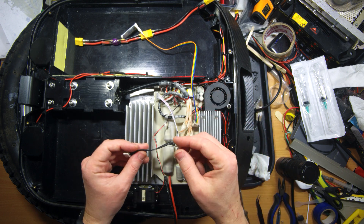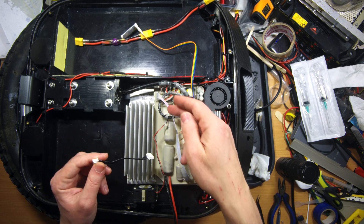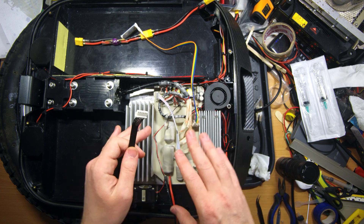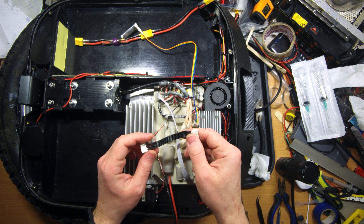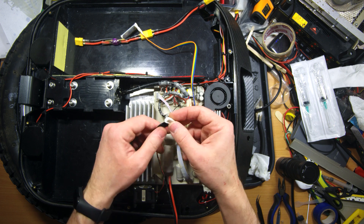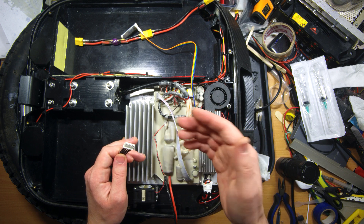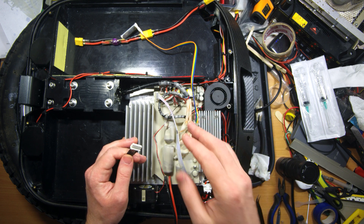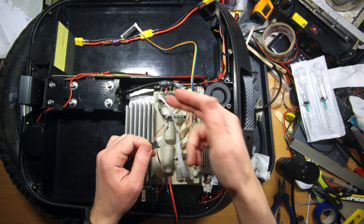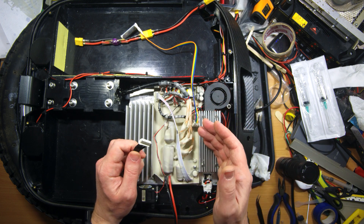When I moved this DC-DC converter, I had the problem that this connector is really short, so I ordered a new one from AliExpress — I will leave the link in the description. Although it fits perfectly here, there was a problem that the pinouts were different from the original one, so I had to change pins on the new one. If you're going to do the same on your EXN or other wheel, please be careful what you are receiving from your seller, because if the pinouts are wrong you may burn your controller board, DC-DC converter, or both.